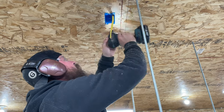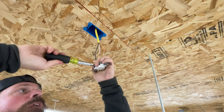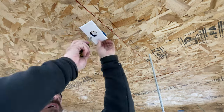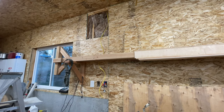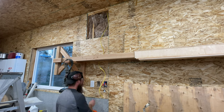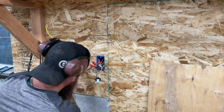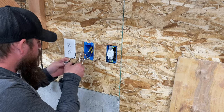I'm not going to go into detail on how to wire this, but this blower motor is 240 volt, so I tapped off my main 240-volt circuit that I run most of my larger tools off of. This blower unit only draws an amp and a half and it's on a 20-amp circuit. Since I'm a one-man show, I'm only running one of those 240-volt tools at a time aside from this filter unit running, so there's really no risk of overloading that circuit or having to run a dedicated circuit just for it. I'll be powering this on and off with a two-pole switch, but down the road I plan on adding the DustRite remote wireless switch for it.